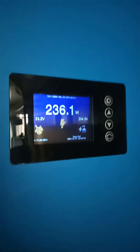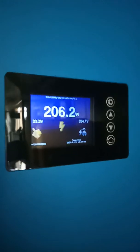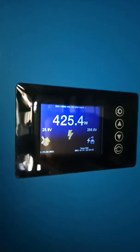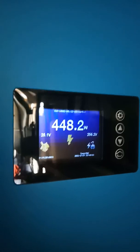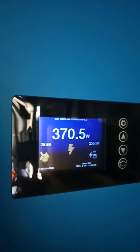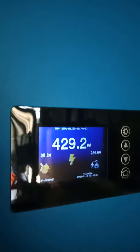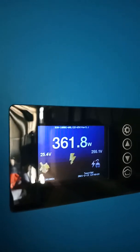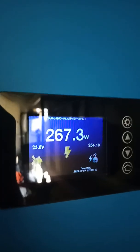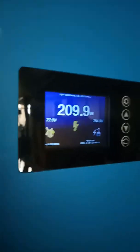Just doing an update. I've had some strong winds this morning. I've replaced my 2000W with this 1000W with the dynamic load of resistors on it. They cannot slow it down enough to stop it with all the voltage. So I've got like 3 ohms across the windings. It just can't stop this unit tripping.